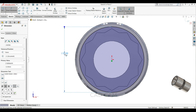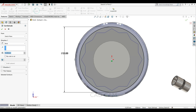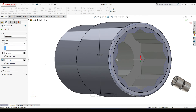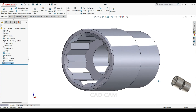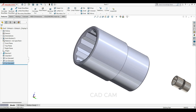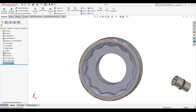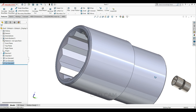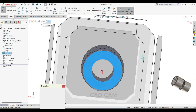Keep 22mm, go to feature, select extrude cut, and select 60 degree. This side face is ready. You can see — now select this face, sketch normal.